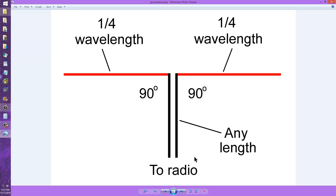The feed line can be any length, and the radio does not have to be grounded. So how do you get current to flow at all if there's nothing for this radio to operate against — no radio frequency ground for it to work against? The answer is quite simple. As long as the feed system in the radio is truly balanced, you will get radiation from this antenna when you transmit, and it will receive perfectly well, but the feed line will not.